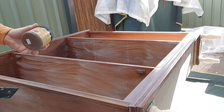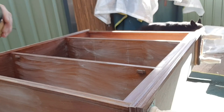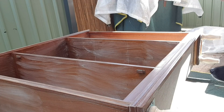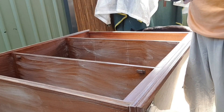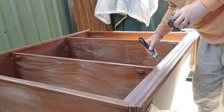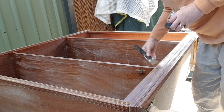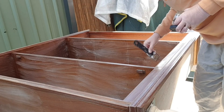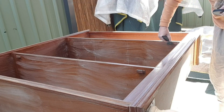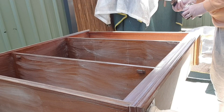I'm just giving it a quick scuff sand all over. I noticed there's a few areas that could do with a little bit of a fill, so I'm going in with Dixie Belle Mud in the brown. It's really where I've removed these support brackets. I filled the main part with Bondo, but there's a little bit left over, so I'm just going to fill it with this - it's really easy and dries quickly. This is the Dixie Belle spatula I'm using with it. Over here there's just a little bit of veneer that's peeled off when I took those support brackets off, so I'll just fill that in. Good as new.